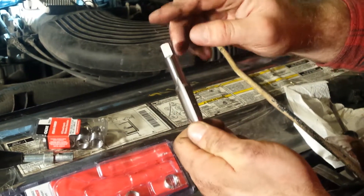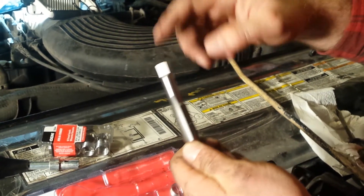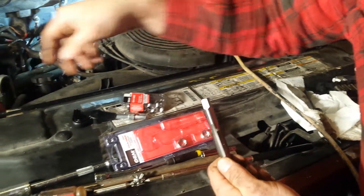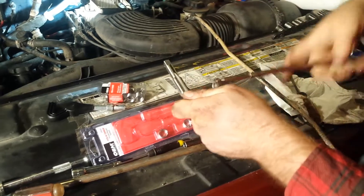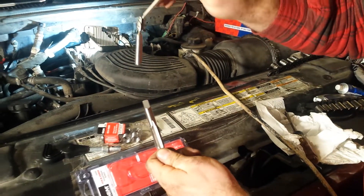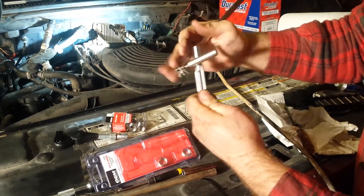You're not in any danger of running it clear down through your head, because you've got about an inch and a half, maybe inch and three-quarters of threads. So once you get to the hard part, give it several more turns to get that threaded. Now this tap goes down in the hole so far you can hardly even touch it. You must have your telescoping magnet, because every time you pull the tap back out you've got to reach down in the hole with it. I don't know any other way to get it out of there.